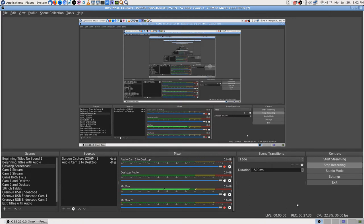Now I've gotten rid of that low-end rumble in the SM58, and that was on the mixer. I tried to do it real mixing style, but with the speakers right here, about 2 feet away from the mic, that's pretty hard to do. You need your speakers not pointing at the mic, and then you can do that perfectly.